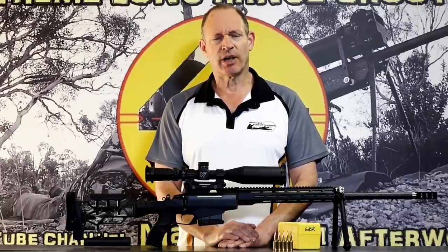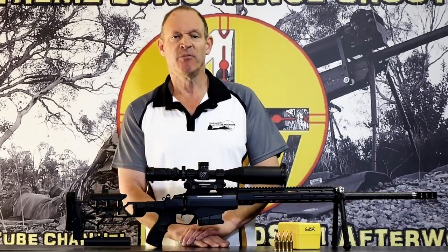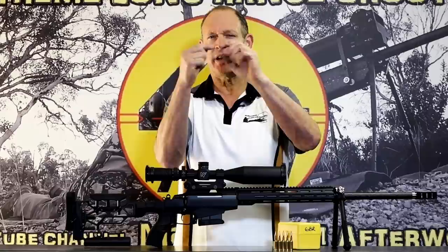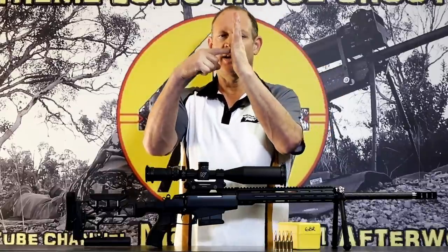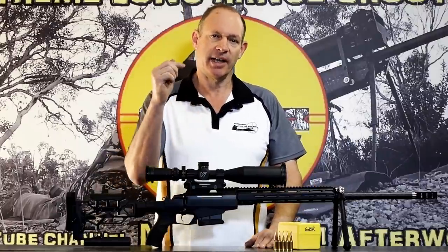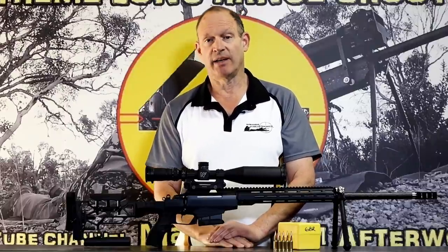But in something like this, with a small rifle primer in the bottom of it, in quite a soft primer like the Federals, which I use all the time, it means that when the firing pin's all the way forward and the explosion has happened in your round and it's pushing that little primer back, at 70 thou you're getting to the point where that push forward and then expansion back, you can imagine, the flat face has to protrude forward and then stretch to come out of it. Potentially, especially at higher pressure levels, it could actually tear because it's stretching that metal too much, and you end up with a little pop, which is what we're seeing.